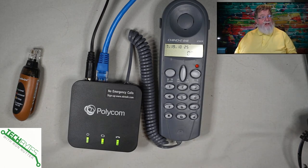It at least shows you that caller ID is passing. When caller ID first came out, I had to spend about $150 for a device that had separate caller ID on it, because caller ID was just new enough that it wasn't in a lot of your more budget-friendly phones. So this is something that's very handy to have, and it's going to serve you well moving forward, because you've now got two pieces of test equipment that will help you see — is the problem the phone, is it the device? If no caller ID is coming through, then that may be a service provider issue or a configuration issue in the VoIP device where your service terminates. This at least gives you a leg up on what to look at, and it's one more thing you can do to troubleshoot it before you start tearing your hair out and questioning your choice of equipment.